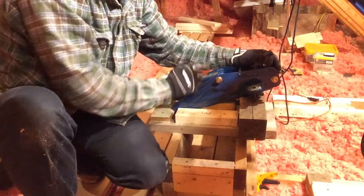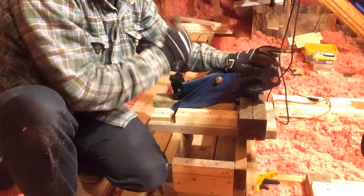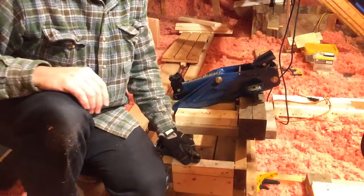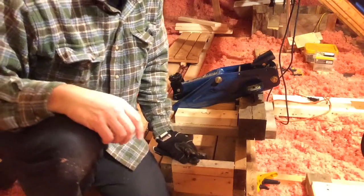Now that this is in place, I'm going to set up the fork like we did before. I'm going to put the 2x4s up in the air and use this jack to lift up the sistering members for truss number 8 so we can mark them, drill our pilot holes, then take it all down, put on our construction adhesive, drive our screws home, and make this truss as strong as we can.